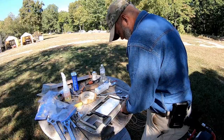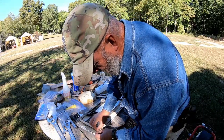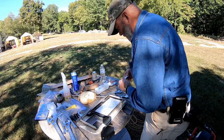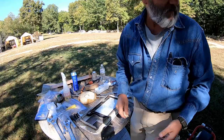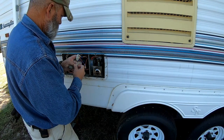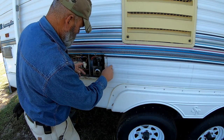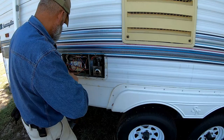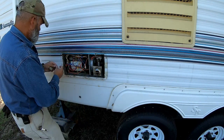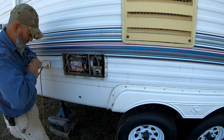And if you've got a situation like this, has a corrugated siding on it, you can double it up and it'll make up the gap, and it sticks to itself really well. So it works for filling up gaps and stuff pretty well. So what I'm gonna do is take some of these pieces and, where the corrugations are that I know I'll need to make up space, I'll stick a little of that in there. And you're much more concerned about the top than the bottom, because it's like shingles or anything else, the water will run out the bottom.